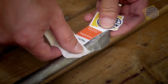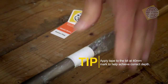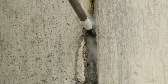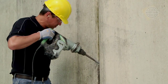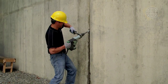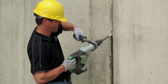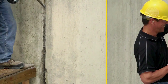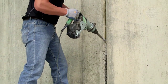To ensure proper depth, it may be helpful to place tape on the chisel to create a quick visual guide. When it is not possible to comfortably chisel downward anymore, do not hold the chisel up or chisel upward, as this will only increase difficulty and result in large chunks of concrete breaking away, widening the chase. Instead, use a suitable working platform or ladder to keep the angle consistent.